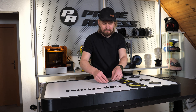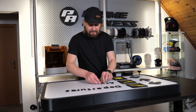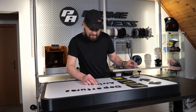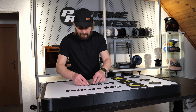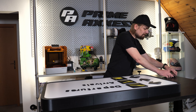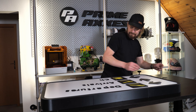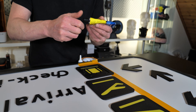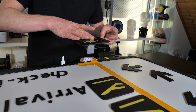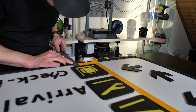The next thing is a huge puzzle and a dance with the ruler to get all the signs in the correct spacing — a bit time consuming but a lot of fun. The letters are 3D now, not just stickers — they're three-dimensional with shadows and highlights, much cooler than foil. I'm using a combination of plastic glue and CA glue: the CA glue bonds immediately and the plastic glue provides long-term strength. The signs won't slip — they stick immediately, which helps a lot when gluing them on.